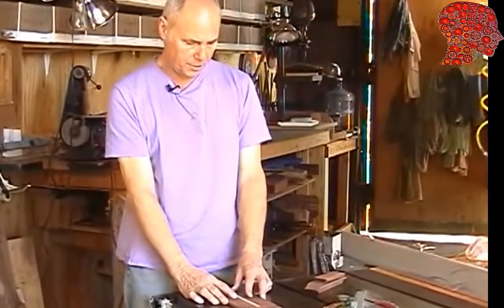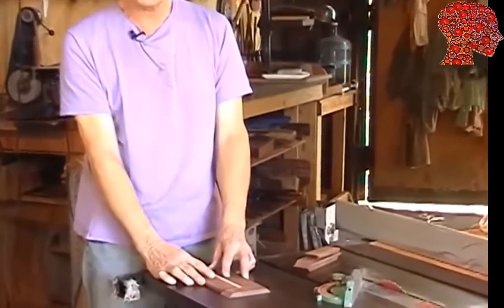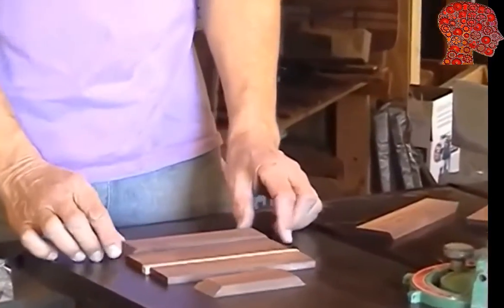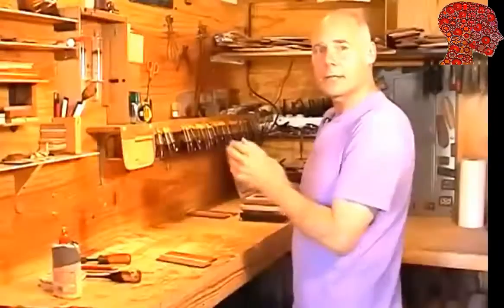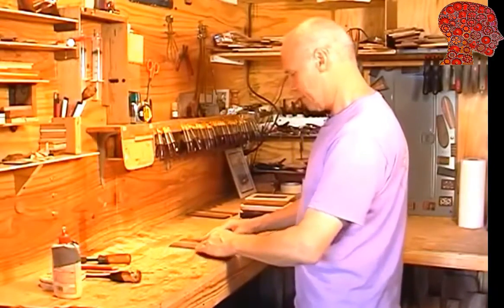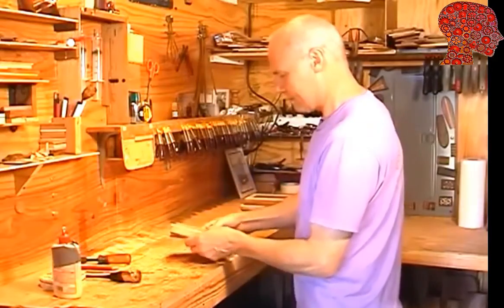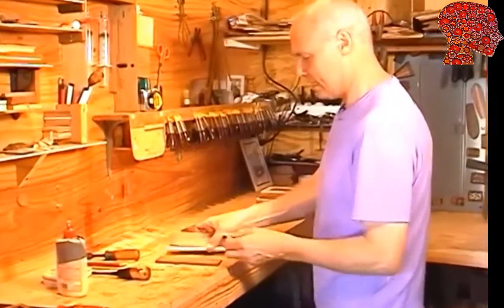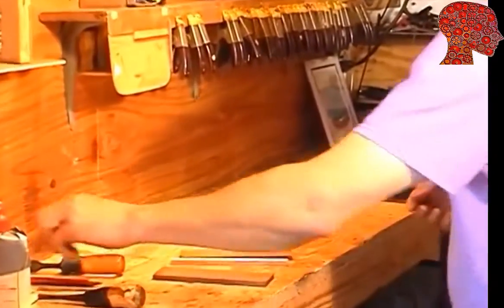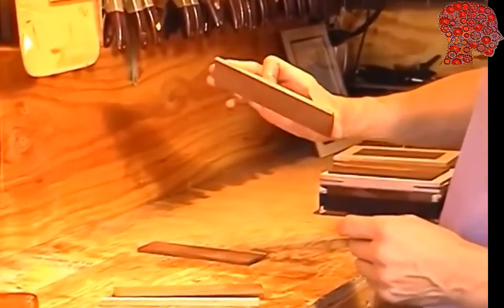You want to make sure that you're building a piece that's slightly larger than the place it has to fit, because again, you'll trim it down after it's been glued. So now we're going to glue together the bottom of the box and what I call the lifter. They've already been milled, so here they are, pretty much set up and ready to go. There's a couple of steps involved when you're laminating together relatively thin pieces of wood.